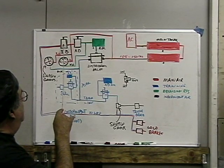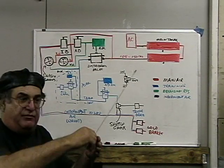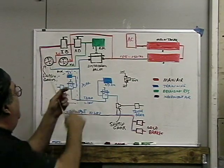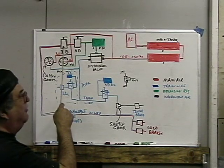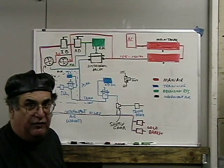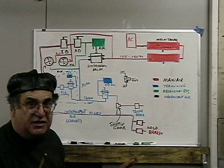What that does is it's zero pressure when it's off, and as you apply it, it increases the pressure, same as an ordinary regulator you have in your shop. It starts out at zero, you turn it, and it goes up to 5, 10, 15, 20 pounds. It does the same thing here, except you've got a handle on it. So you have zero pressure, and as you increase it, 5, 10, 15, 30 pounds, I have it set so at 30 pounds the wheels are going to slide. There's no way you're going to move that. No way. 30 pounds.